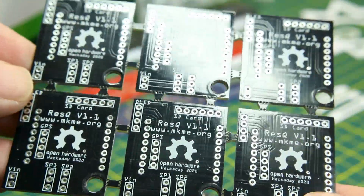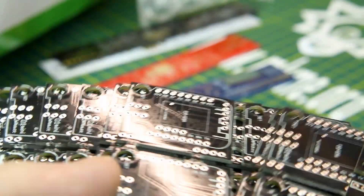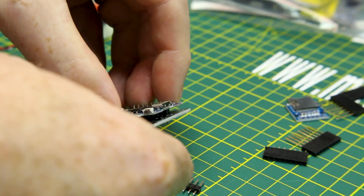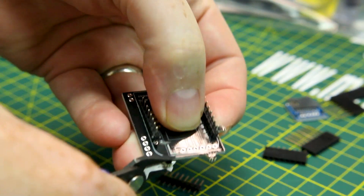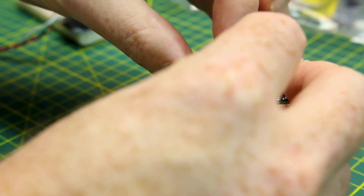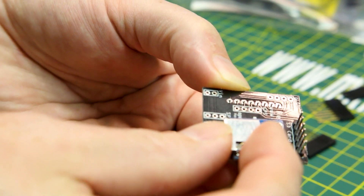My design and layout definitely could be better, but for version one — the very first PCB done in Fritzing — I'm really happy with the results. These things will be completely serviceable, but we won't know until we start putting them together. I always take and lay things out, make sure the fit and finish is correct, make sure I had the footprints right before I get too invested in the project. Remember, the footprints don't always match the actual components from the EDAs, but in this case mine are super straightforward. A pair of side cutters is essential in your electronics lab — they're great for trimming off these little mouse bites and leaving a nice smooth edge on the PCB. You can even sand it a little bit if you choose. The outside edge ones will be smooth, but anything with the mouse bites is always going to have a little bit of an edge.